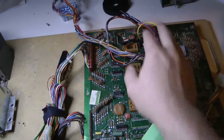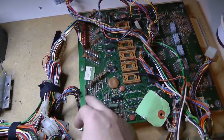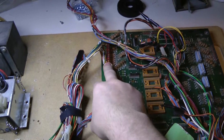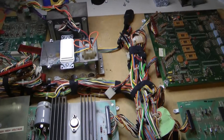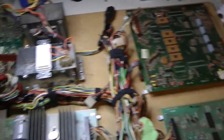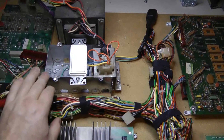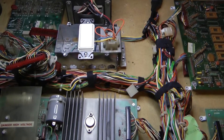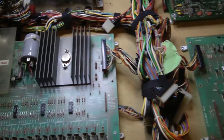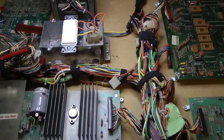For the MPU, there's various boards which I have which will work with that. I've got the memory expander board for J5. I've got boards to test the switches. I have also designed a board to show when the MPU is driving solenoids — effectively a little mini solenoid driver board which will mount there. I also have a display board which will mount on here. I've got this Bally Stern test bench pretty much ready to go. I've got the Medusa harness mounted down to the board, all the circuit boards mounted, a transformer and a rectifier board. I've installed a switch to switch the whole thing on and off. I'm going to add another switch for the high voltage but I'll do that later. In the meantime I can use this to start testing boards and developing new boards, and I also want to use this test bench to shoot some videos about how the different circuit boards work and how this whole thing adds up to be a pinball machine.